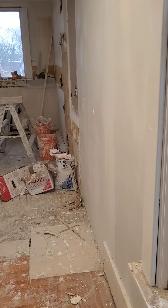Here also was a good three-quarters of an inch difference from here all the way to this light. This whole section had to be filled right up — about three-quarters of an inch of mud all the way into the corner to make it look flat. I'm going to have to do basically the same thing again, but this time it's going to be about a quarter of an inch to fill it just to bring it past the tape.